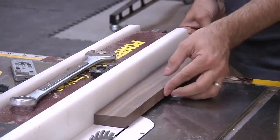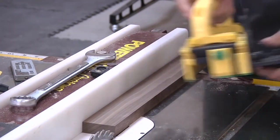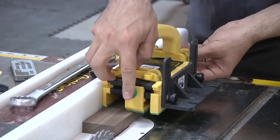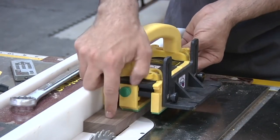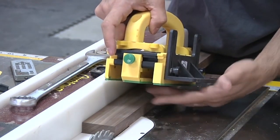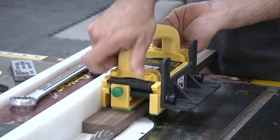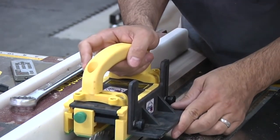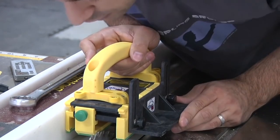So let me take this skinny piece of walnut and take about an eighth of an inch off the edge using the gripper. The first thing I like to set is the adjustable foot—I want the large foot resting on the work piece to get the benefit of all that extra surface area. I'll push it over to the right, just clearing the blade and keeping it fully on the work piece.